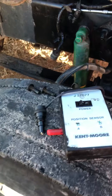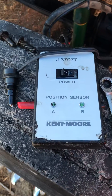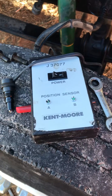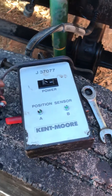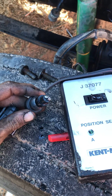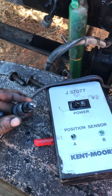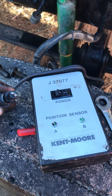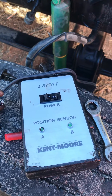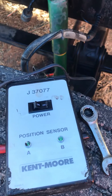To take this pump out you want to set it at top dead center, and to do that you need this special tool — it's kind of a unicorn. This one was pretty expensive, about 700 bucks. It's got two detents that press in, one for the A and one for the B, and when they are pressed in equally both A and B light up, meaning you're at top dead center.